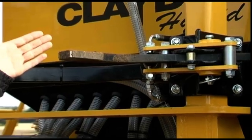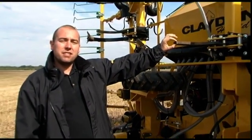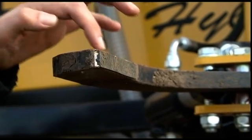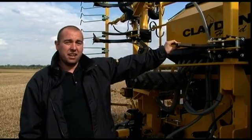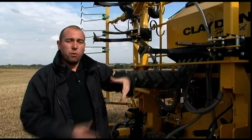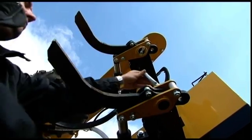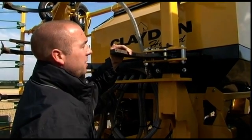The machine features our own design tungsten carbide faced front points. They have five millimetres of tungsten carbide down the facing of them and they're a throwaway tine. The benefit of this is that there is no weak spot on it because it's a one-piece complete tine. It goes through the ground and wears very evenly. The tine is adjustable purely and simply by pulling the pin out and putting it down to the depth which you need for that particular crop.